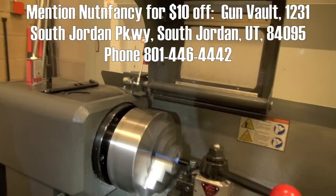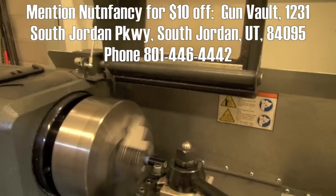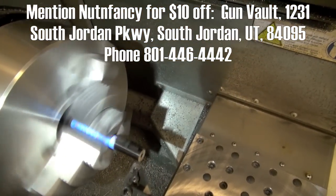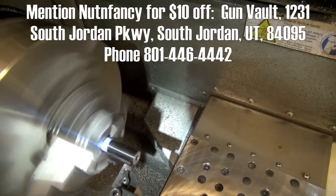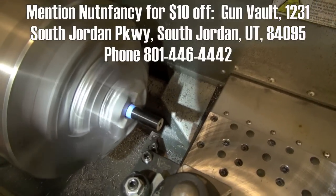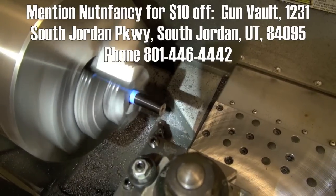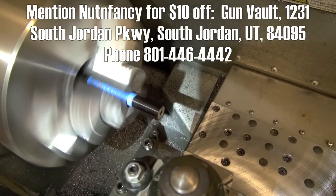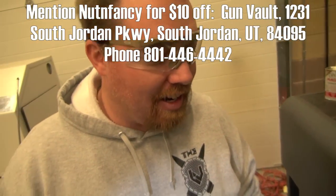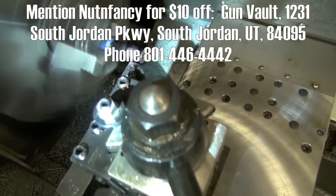We'll normally be running coolant and have this guard down, so we're going to cut this dry so that the filming is easier to see, and then when we thread it, we'll put some Tap Magic on there to make sure everything turns out okay. And normally we don't hang this much out of the chuck, but you can see it's starting to cut right there. We'll usually have it a little bit closer to make sure we don't get any chattering out of it, but with that sight, we kind of have to hang it out there a little.